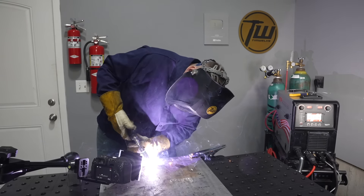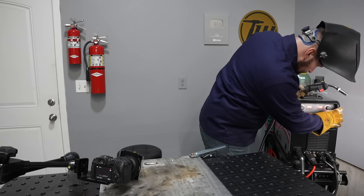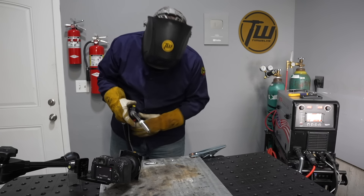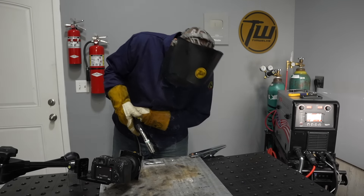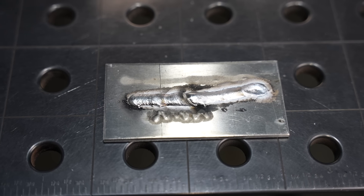With the baseline settings I'm starting with, it's creating a fairly large droplet and short-circuiting a little — I don't want that frying bacon sound like I'd have with steel. With any wire feed process, voltage controls your arc length, so I turned up the voltage and now it's just a smooth, straight spraying motion. That's what I'm looking for, and one volt makes a significant difference.